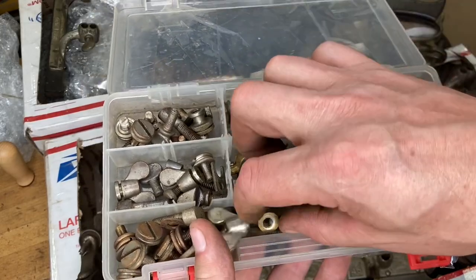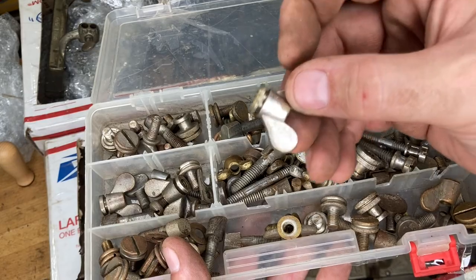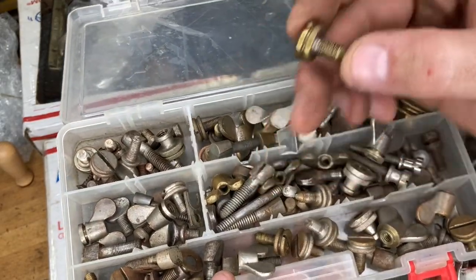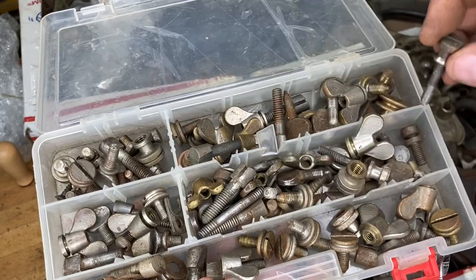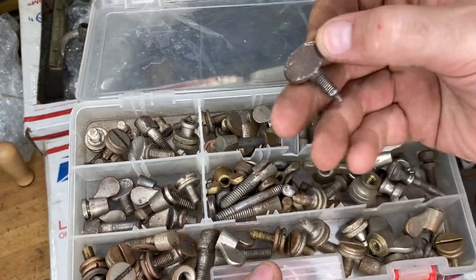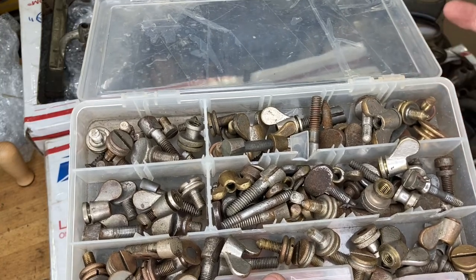Here's a little box of goodies. This wing nut holds the blade in place — it's super common for these to be sheared off like that. This is what it's supposed to look like. If you don't loosen everything properly and keep cranking, it will shear off. These are the older style screws. The early-early ones were brass and are a little more sought after for the super early 45s. There's the knob screw that holds the knob for later models, and the pointed set screws are for the fence as opposed to the flat-ended ones used elsewhere.